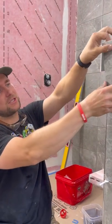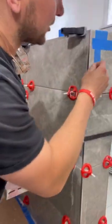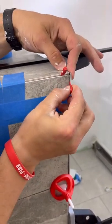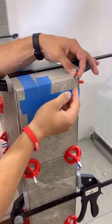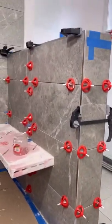We finished this up. Be careful with the clamps so you don't go too tight because you could mess with it. It's very important to have clamps, some tape, and these little wedges. In a situation like this, where I want this piece of schluter to come out just a hair more, I'm just going to get a wedge in there just a little bit — and now this is extremely perfect. That's like 30 seconds or less. This is super important to have on here. Take your time with something like this, touch all the areas and make them work.